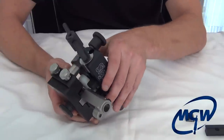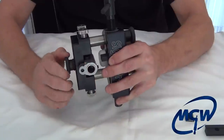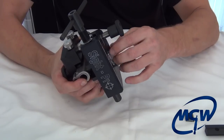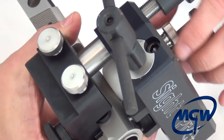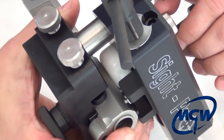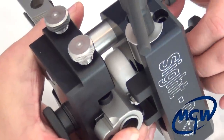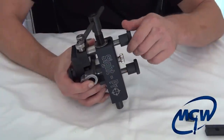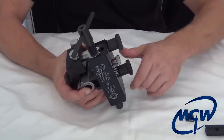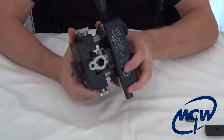So what you do when you push it down — slide it back, clamp it down — you can take this knob and turn this little screw to raise up the Delrin pad in very slight amounts. It's a very fine adjustment so you can see the clearance you need. Once you have it where you want it, bring down the clamp and that sandwiches everything together.